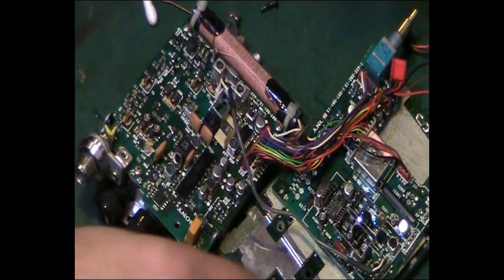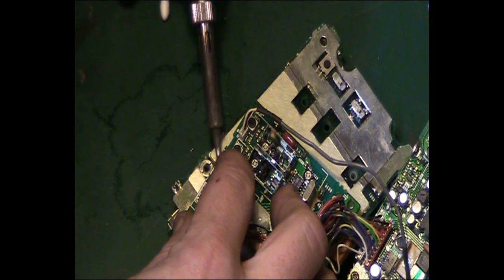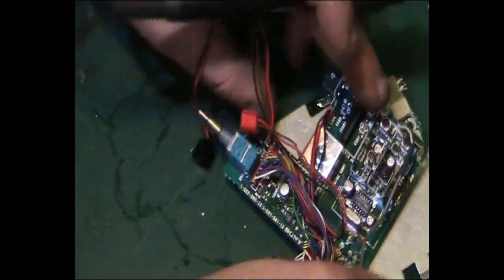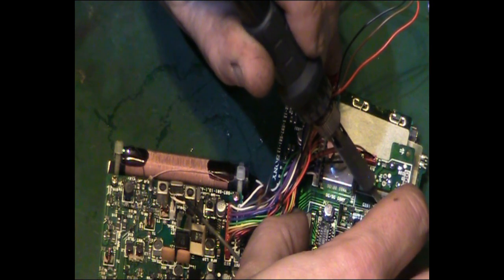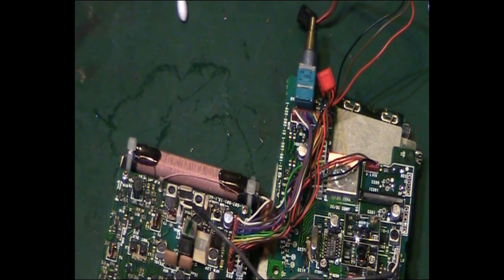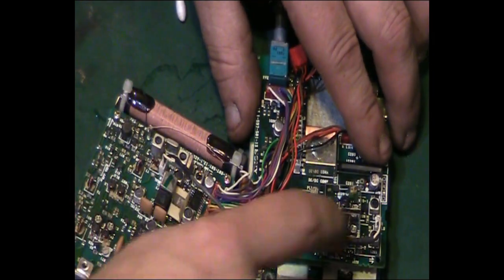and we'll go back and we will just straighten that capacitor up, because I have got it a little bit on the skew. We'll just remelt that there, just pull it over there. That's much better. Then we'll spin that around so I can see the other side again. And we can just make sure that's nice and straight, that side as well. And there we go, perfect. Yep, I'm happy with that one now. Put my iron down. So that's, oops, where can you see? There we go. So that one's replaced.